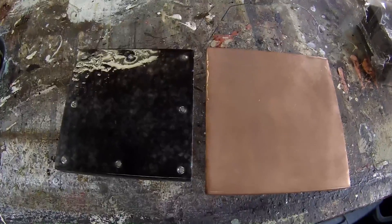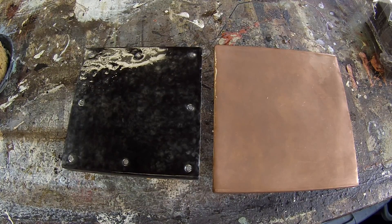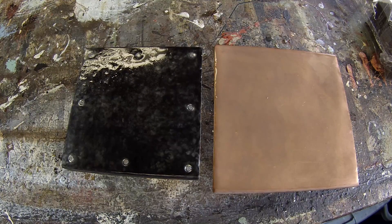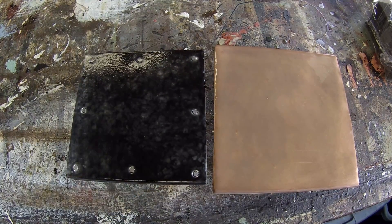Another tip: make sure your work surface is reasonably level before applying the solution. If there's a low spot on your countertop, the liquid will run and collect there, causing highly contrasting effects you don't want. For best results, keep it level and remove as much excess liquid as possible. When I'm done applying initially, I go over it a few more times with a wrung-out sponge, sometimes using a paper towel to remove excess, then finish with the sponge for an even texture. That final texture has a lasting effect on the appearance of the patina.